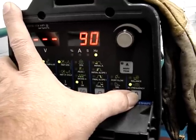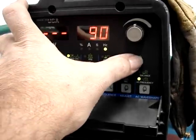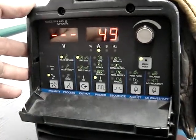That seemed to work pretty well. In previous videos I said you can set AC frequency at about 100 to 120 and weld most anything — that would have worked here too, but 90 seemed to work a little bit better. So this is the Dynasty: it's able to light up on this thin aluminum without blowing a hole. It's got a good sure start. At low amperage like this — only about 11 or 12 amps — sometimes the arc just kind of flares up and gets funky, but overall pretty good.